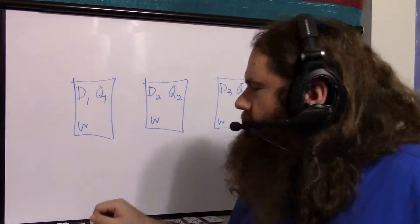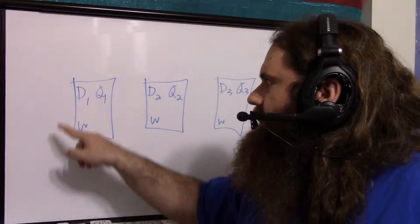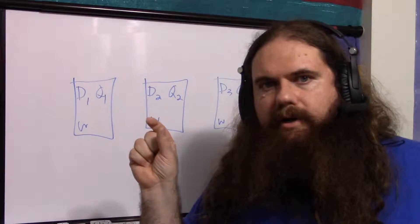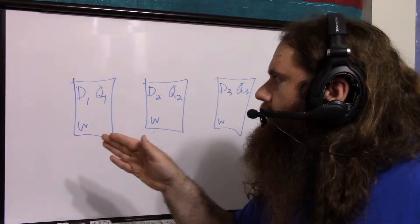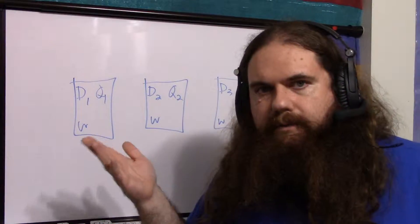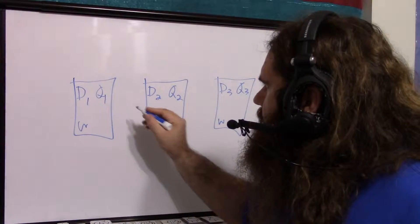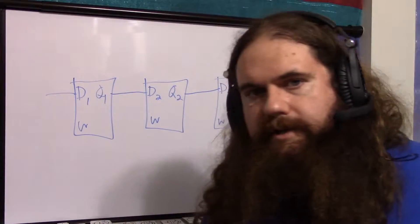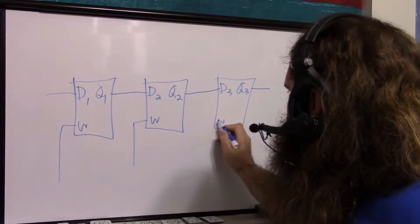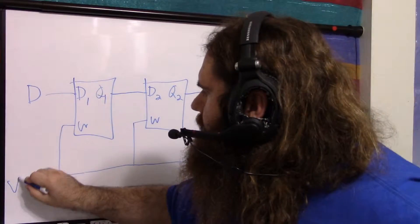The interesting part is serial. One way to do one bit at a time would be a multiplexer with a bit as your input or output and a specifier to select which flip-flop to write. That would work fine but would be a horrendous amount of unnecessary wiring. Instead, we just tie these together, and the entire register ends up with only three wires: D, Q, and W — though I'm going to call it R/W.